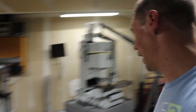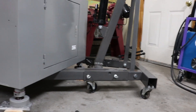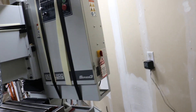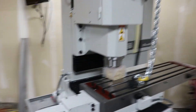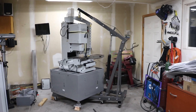Alright folks, it is on the stand. I apologize for not recording it, but sometimes when you're doing stressful stuff like that you don't want the added stress of people watching you, even in cyberspace. I've got the stand on a couple 2x4s and a half-inch piece of aluminum — that was enough to get the engine hoist underneath it. The hook is all the way as tight as it'll go, and we've got it on one ton because that was as far out as we can go and still be safe, since this thing weighs like 1,500-ish pounds, maybe a little more. It came in from the right side of the machine as you're facing it, and it seemed to work. We pretty much just fought it a little bit with it in the air, shimmied it around until we got all the bolts started. All the bolts are in place now. We're going to go ahead and unbolt the engine hoist, back it out, and grab the pallet jack to put this thing on the ground.